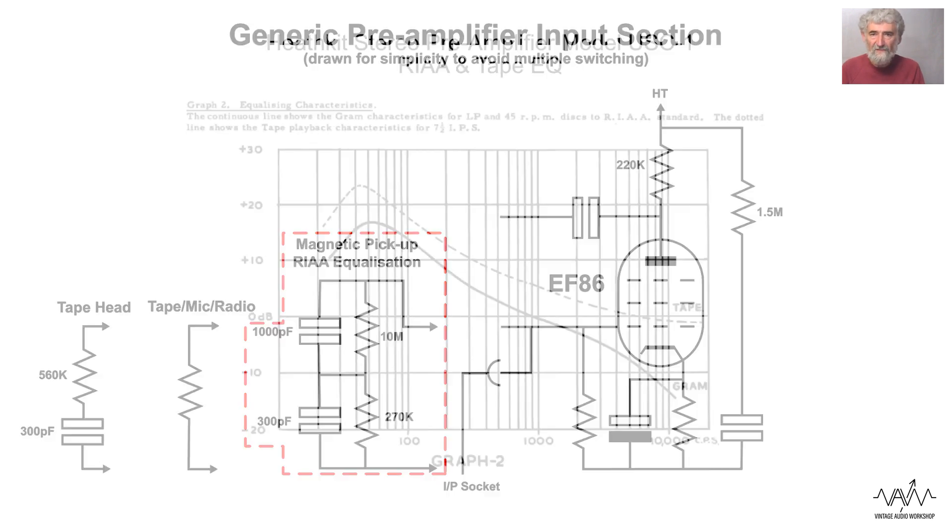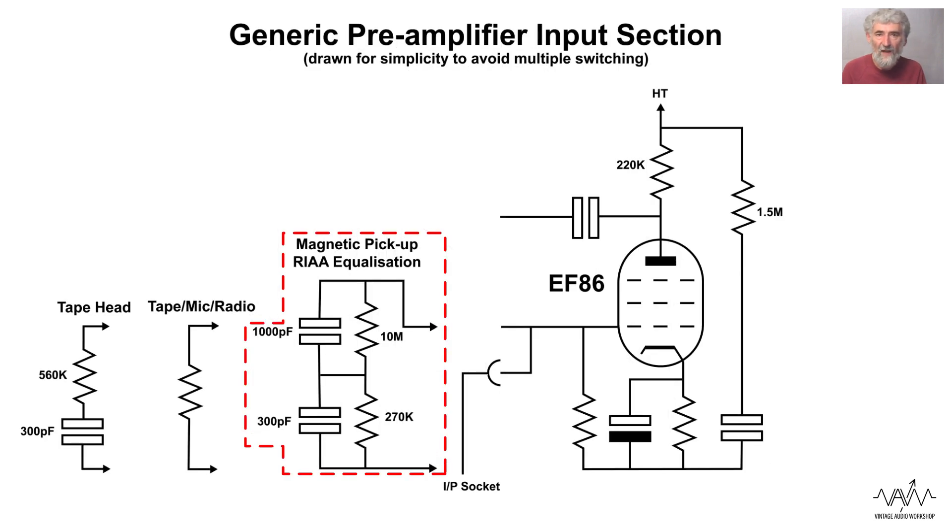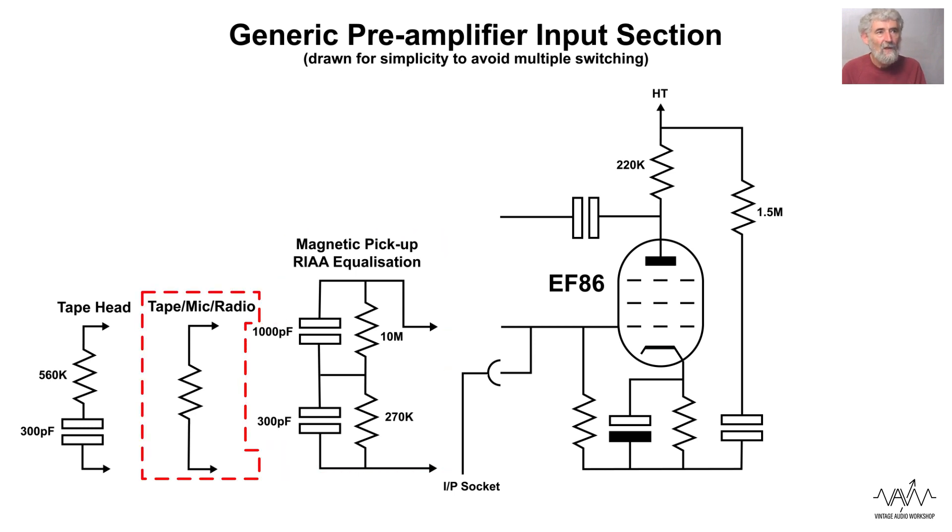So this circuit is flat for the mid-range of audio signals. It seriously attenuates the high-frequency end and boosts the bass end - both statements being relative to the middle, which simply has flat negative feedback. That is chosen to give the right amount of gain, which is considerable for a magnetic pickup of the modern type. If it was a 78 pickup, you would stick it into one of the auxiliary inputs and need quite a lot of attenuation because they had much higher outputs. For mic, radio and tape, you do not need frequency compensation - you just have a resistor, but the value of that resistor varies. Radio may well be the highest output, so you would have the lowest value resistor to give the lowest gain.